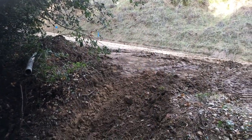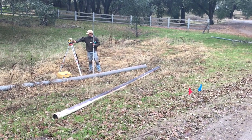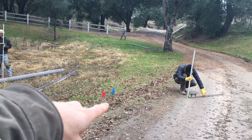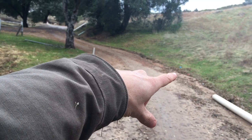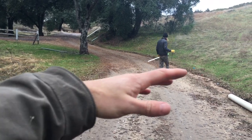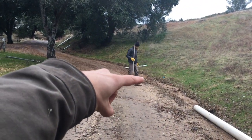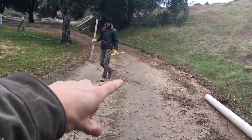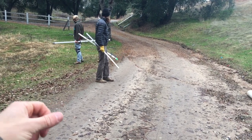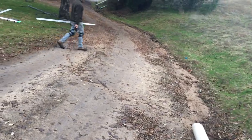Here we are Day 3, starting Rolling Dip number one — the highest rolling dip in the drainage. We're going to use the laser to measure the native height difference from our exit point to the start of the crossing up here, figuring out the current situation — whether we need to remove material or pile more up. Wes is taking measurements using the grade level of both the native grade of the drainage ditch and the actual road, because when we make the bottom of the rolling dip we want to ensure we keep the same grade as the inbound road grade or make it slightly steeper, so the bottom is self-cleaning and not prone to filling with sediment.